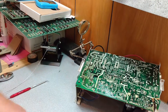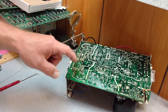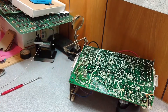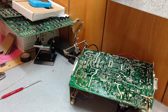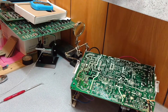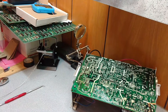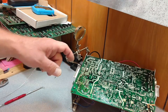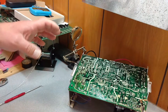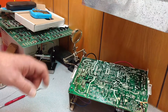You have to be super careful with the heat. This board is busted with a bunch of other problems — it's just a junk board I have laying around, so I wasn't too worried. But make sure to be super careful with heating. Sometimes you want to use the low setting because you only need to heat it up to about 500–700 degrees at the most to liquefy the solder. The key is also to add solder first, because old solder won't heat up well and you'll damage the board drastically almost every time if you don't add fresh solder first.